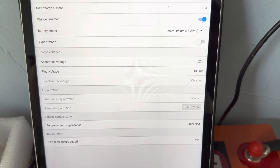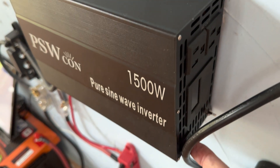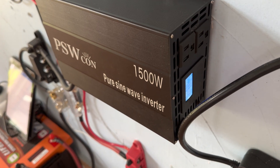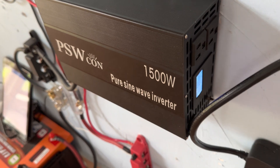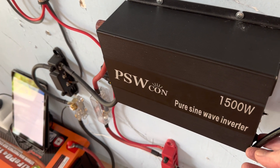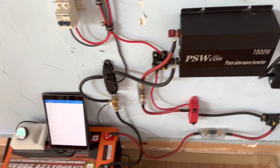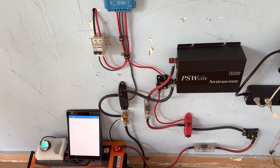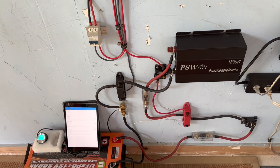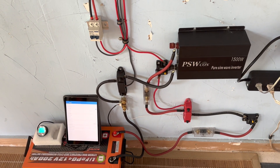Just as a last little test, let's turn this on and make sure we don't blow any fuses. I'm good to go - the coffee making station is back in operation. Everything's good. Turn that back off. That's it, that's all it took to switch that back over from 24 to 12 volt. I did a video going from 12 volt to 24, and it was just the same thing but in reverse - it worked very well for many many months.